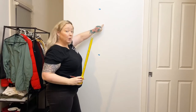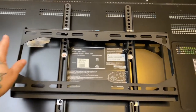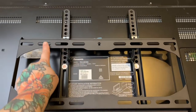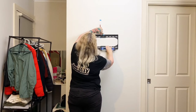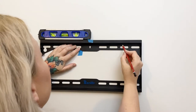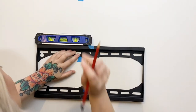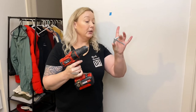That should be our center point that we want to line up with the center point of the top of the mounting bracket. Let's lay the bracket on here so we can figure out where we want to use our holes — we don't want to use holes that are too close to the edge, so we're going to use the second from the end. Bring the mounting bracket over to the wall, line up the center point with that mark, pop the level on top and get the bubble centered. Mark one circle at the second-from-end hole and one circle on the other side, and also mark for the bottom holes on the outer edge — apparently a diagonal pattern is a little better.